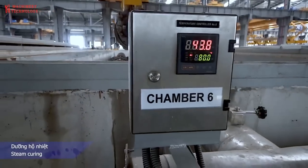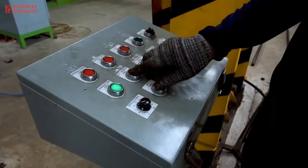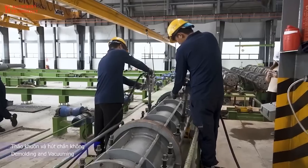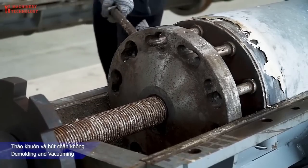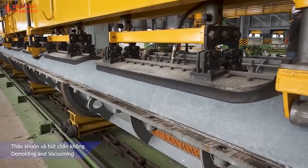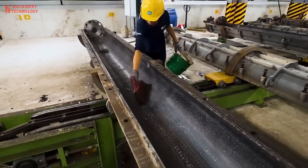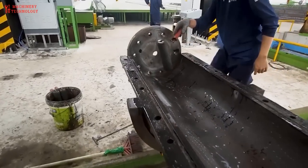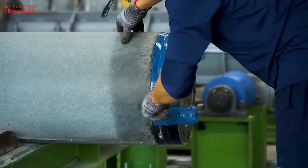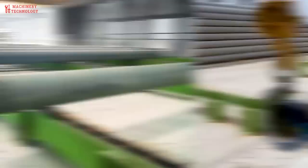Lifting the mold with the concrete pile into the steam curing tank, allowed to stand for 2–4 hours, then heated through steam curing to 80–85 degrees Celsius, approximately 3 hours. After that, the temperature is maintained at 80–85 degrees Celsius for 6 hours, then cooled to room temperature. Secondary autoclave curing: the autoclave is heated to 175–185 degrees Celsius for 3–4 hours, raised to 0.8–1.2 MPa pressure. After maintaining the temperature and pressure for 2–3 hours, all pressure is reduced to atmospheric pressure in the autoclave.